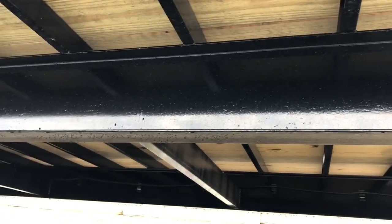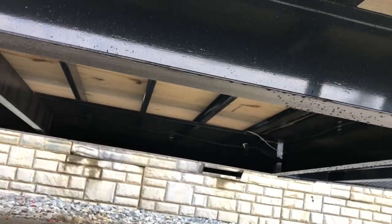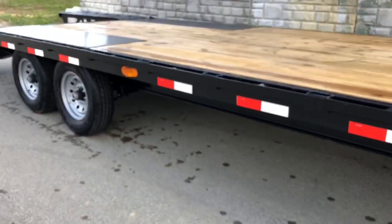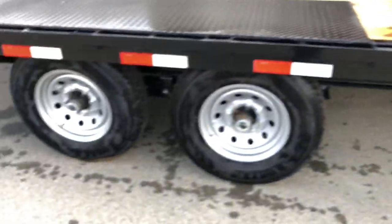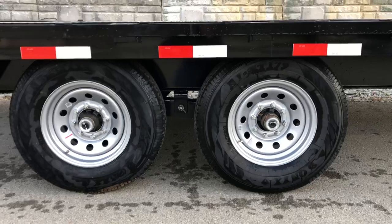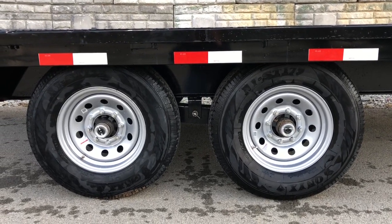Notice they've got a 6-inch channel bed cross member going across and then a 10-inch beam going across the front. The wiring runs back in a sealed wire harness with clips holding it to the frame. Heading on back to the trailer — some things you don't always see. Mid marker light. It's also got Dexter axles — these are 7k Dexters — with the newer never-adjusting brakes.